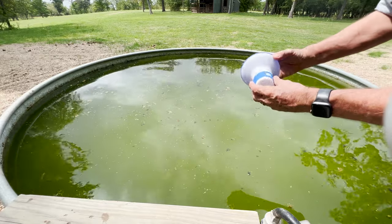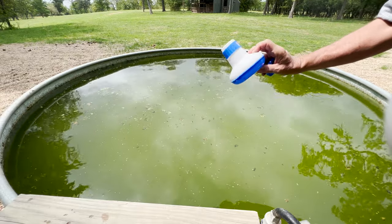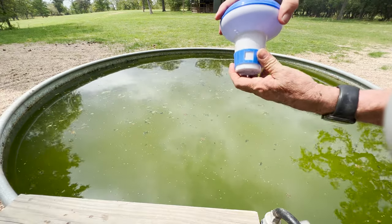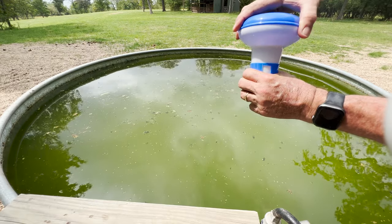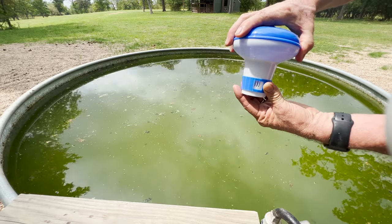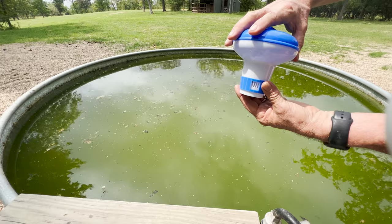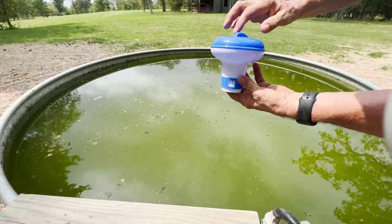The other thing I'm going to try: I ordered these chemical dispensers for chlorine, for swimming pools. These things are like $3.99 a piece, and I got one for every trough. You screw off the lid, put some chlorine tablets in there, and then regulate how much chlorine is going to ooze out via this nozzle here. I can cut it almost clear off where there's just a little bit, or go to one notch, two notch, or full bore. The chlorine I ordered is on back order, so we'll see when it gets here.